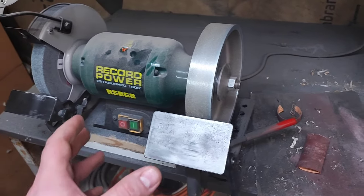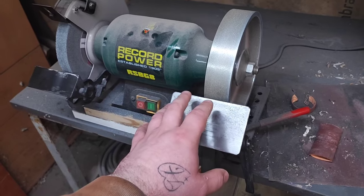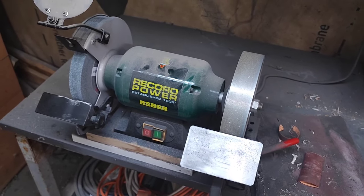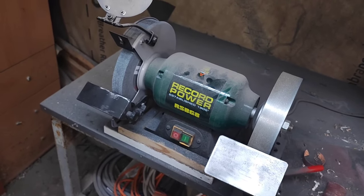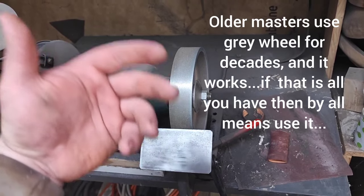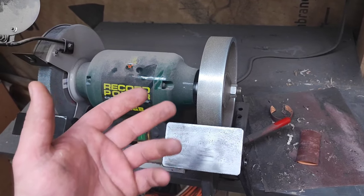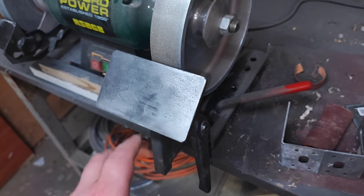You really don't need fine wheels — 180 grit is more than fine for everything we do, even with the skew or any other tool. We're going to sharpen one of the difficult tools for beginners to freehand sharpen, the bowl gouge, using the platform. I'll show you how to sharpen it and then show you on a piece of timber. I'll sharpen the bowl gouge using this gray 60-grit wheel, and you won't see too much difference — proving you don't have to go to an absurd amount of expense to buy the smoothest or finest wheels.